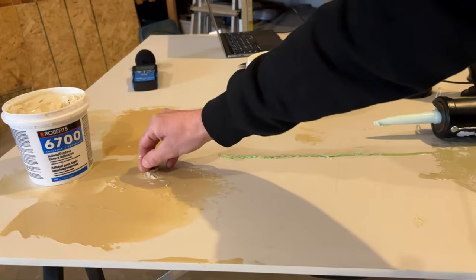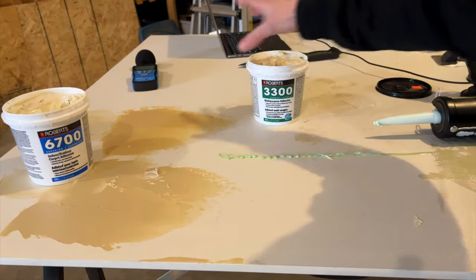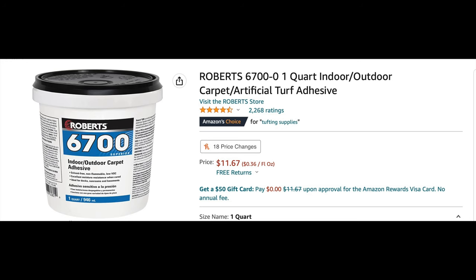There are different types of carpet glues — some more liquidy, some more tacky. Based on sound tests I've done in the past, the more tacky one is what you should use. It doesn't cost much to add this as a soundproofing finishing touch. By spending so much money on green glue, you're basically stopping yourself from spending money on material that actually works at blocking sound.